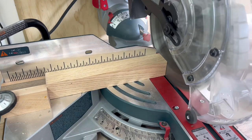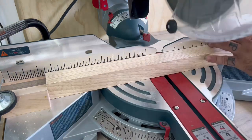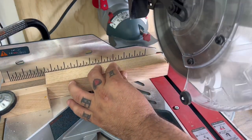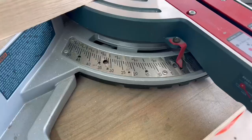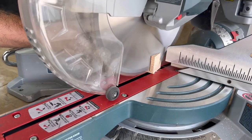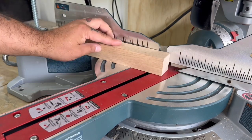I'm starting things off a little differently for this video. I'm building a custom base for this dresser because it didn't come with any legs or base to sit on, so I'm going to build a nice mid-century style base out of red oak. I'm going to give it a 15-degree cut so that it'll sit at a tapered angle and give it a more modern look.